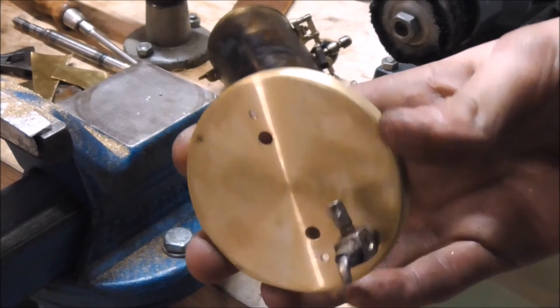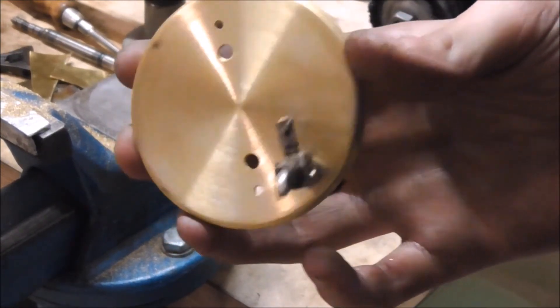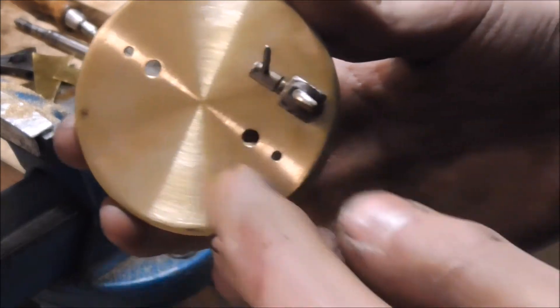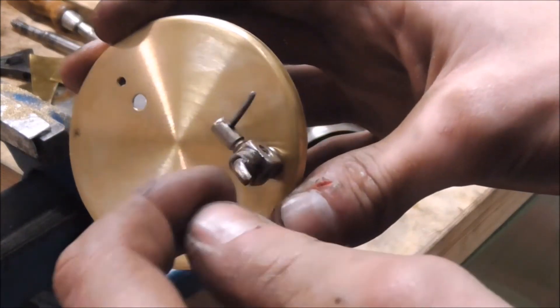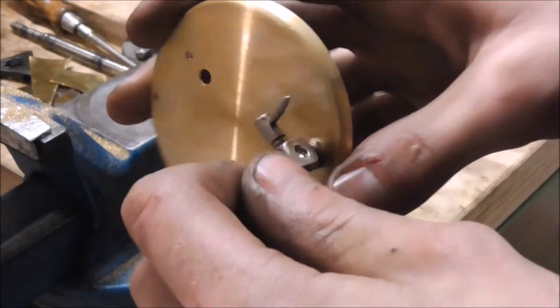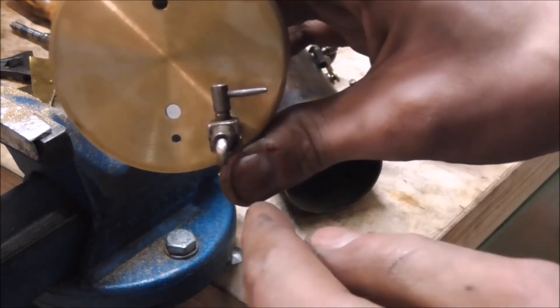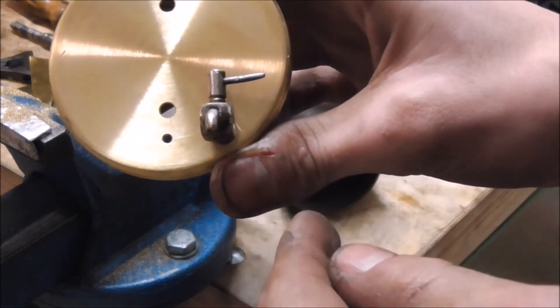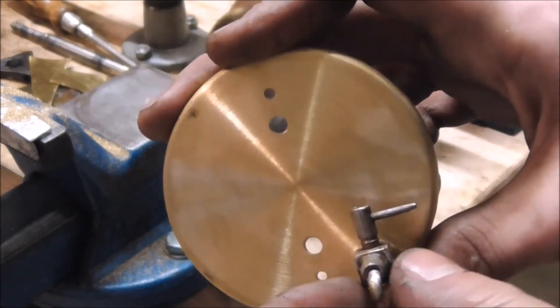As you can see, I have sanded and polished the circumference of the boiler cap a little bit. Holes are drilled and tapped. I already remounted the drain cock, as it is secured by a nut from behind, so that you can move it so that it is really pointing downwards and then secure it into place. That has to be done before soldering the cap back on.